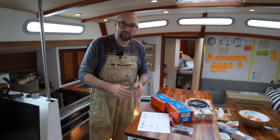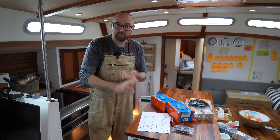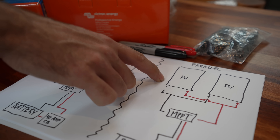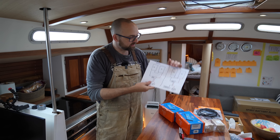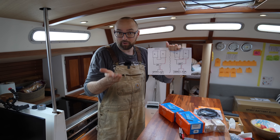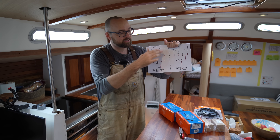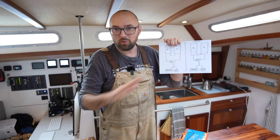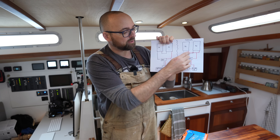In terms of choosing between series and parallel, there are some pros and cons to each, and those depend on what type of solar panel you've got, where you're gonna be installing it, and also your battery voltage. In short: if you connect the panels in parallel, you keep the voltage the same and you up the amps, whereas in series you keep the amperage the same but raise the voltage. When connecting panels in series, you raise the voltage, which means you can go with a smaller gauge cable — but there is one giant downside: if one panel is shaded, you get zero output from that entire array. On the other hand, if you connect panels in parallel and you shade one panel, that in no way affects any of the other panels — but you are upping the amps, so you may have to consider that for your wiring. Ideally, when connecting panels in either series or parallel, you don't want to mix and match.